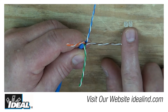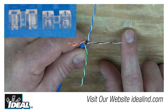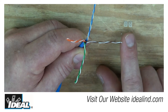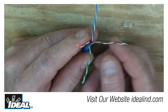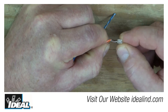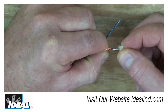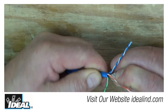After stripping the outer jacketing, install the sled device on the cable. On that little sled device there's an opening on one side and a slot top and bottom. First, decide whether to wire 568A or 568B — in most cases it'll be the B format. With the B format, orange should be on the left and brown on the right. Make sure the conductors are pinched tight together before untwisting anything, then install those conductors into the sled device and push it all the way down to the jacketing.